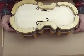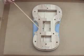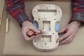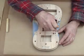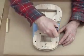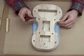I will let this set up for 24 hours before I proceed to the next step. I now have to separate the lower portion of the mold from the ribs and the blocks without damaging the plate. Normally what I do is I take a skew chisel, insert it in the area — the split at the block that holds it to the fixture — and slowly work it down in there without putting any side stresses on the rib. Normally it would just pop right out just like that one did.